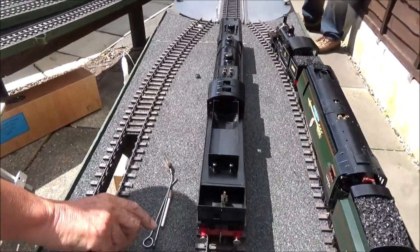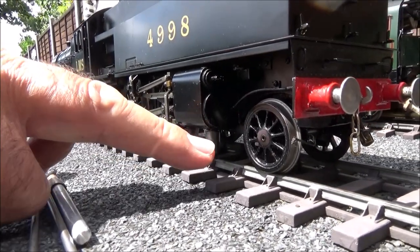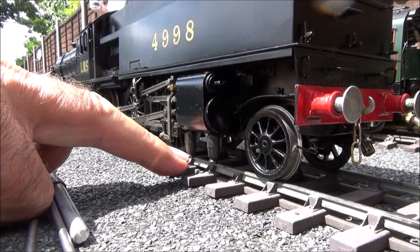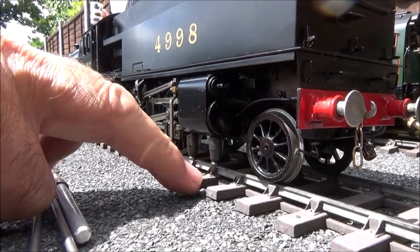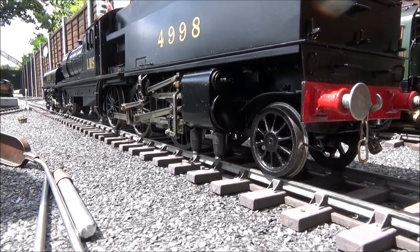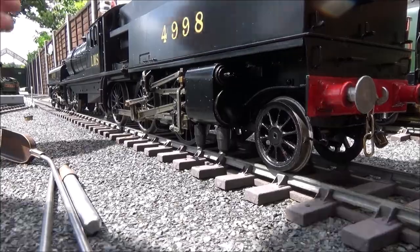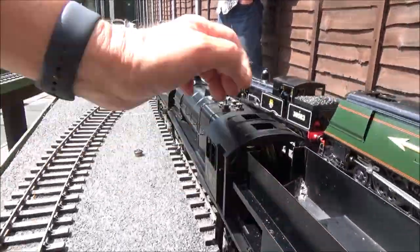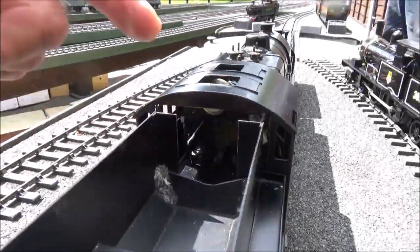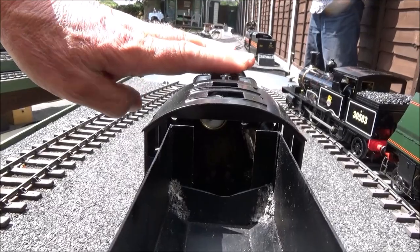One thing I didn't mention, we come down here, Ron. It has automatic cylinder drains. Yeah, I know that. Spring loaded all round, so that makes starting a bit easier. In terms of other controls, it's simple. Blower and regulator, and water gauge is in there, pressure gauge. And that's about it. There are four working safety valves,